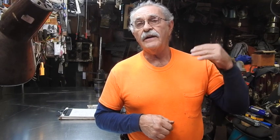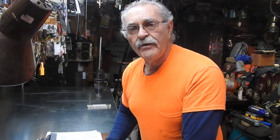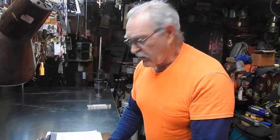There's other control stuff we'll get around to later. Right now we're going to be building a damper assembly that's going to go on the supply air trunk line off of the wood-fired furnace, tying into the trunk line on an electric air handler that already has motorized dampers installed in the supply air plenum. This fitting is going to house the actual dampers — it's going to be 12 inches long and 8 by 20. We have to fabricate the dampers and put them inside with the bearing kits, linkage arms, and all that.